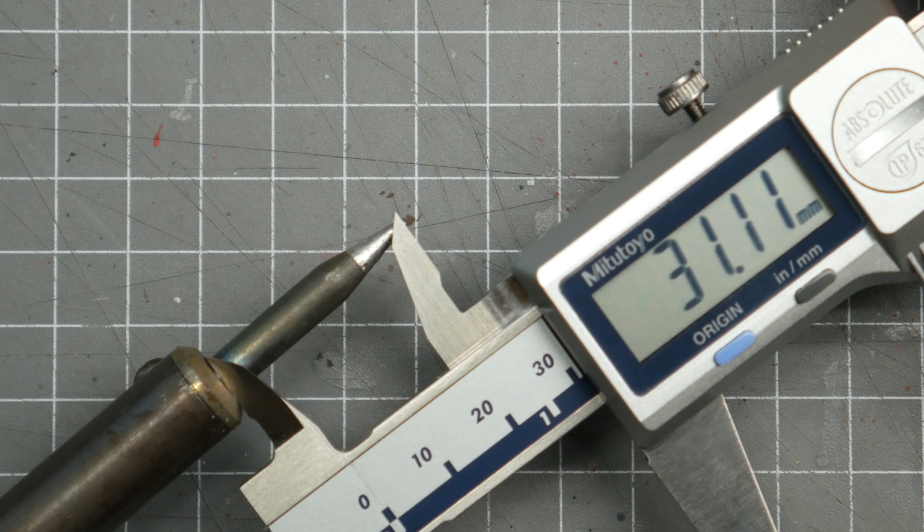It uses a 3.5mm audio jack for power, which is a little odd, but it works. It'll run off any USB port or power bank that can supply 2A. I've personally been running it off a cheap 18V power tool battery with a USB charger attachment and it's worked fine. Because of its size and with it only needing USB, it's very easy to handle and maneuver around, much easier than the Tradeflame one. It also apparently has a vibration sensor which can be handy when it goes to sleep, although mine doesn't work all that well. You can also get replacement tips, but they can be a little hard to find and sometimes can be more expensive than just buying a whole new iron.